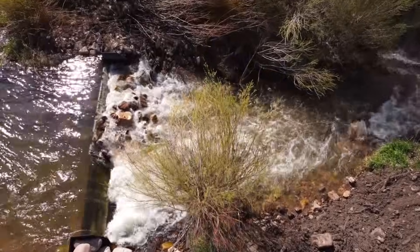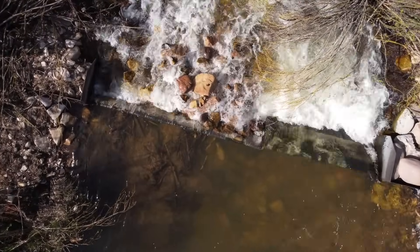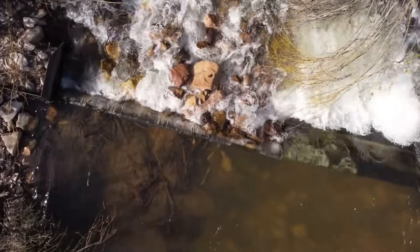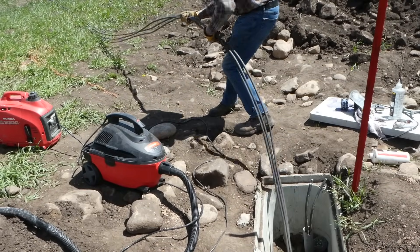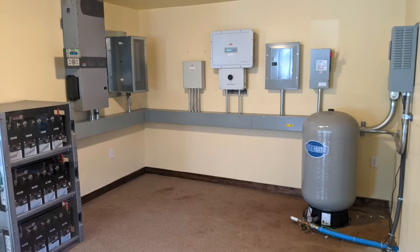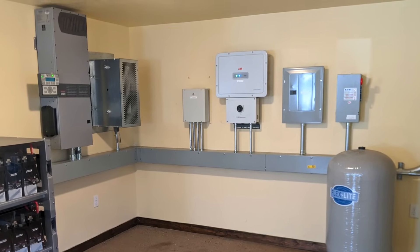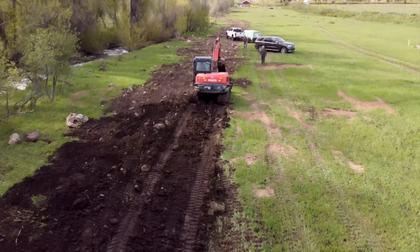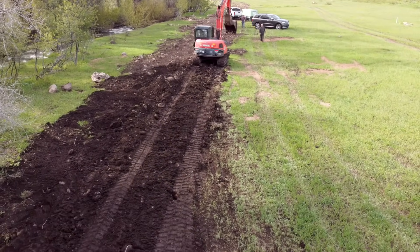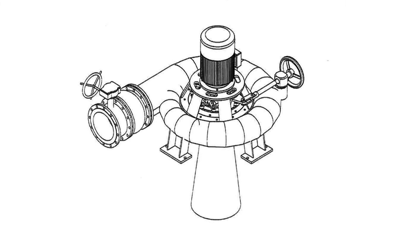The design for flood level capacities of the diversion dam has proven its function, and the overflow section of the dam easily accommodates this springtime runoff. The work that remains to be done is the wiring of the entire system, the installation of the electrical equipment that regulates and collects the harnessed power in batteries, and the final grooming of the grounds where the dam, penstock, and conduits have been installed. The Francis Turbine design is named after James B. Francis, who designed it in 1848.